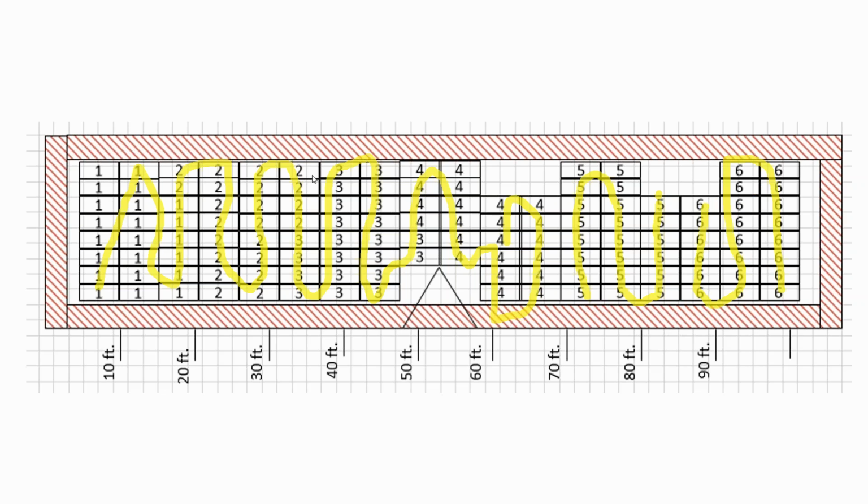But on the roof, you're plugging the modules into the manufacturer provided optimizers, or you're plugging the modules into the manufacturer provided next door neighbor. And so the connectors just snap together. But when you get to the end of the circuit, you have to build a connector and run that circuit back to the inverter. So guess where the failure is? Now, I used to say that the inverters were the number one part of failure in a system. That's no longer my experience. My experience is that the connector that is built in the field is the number one failure point.